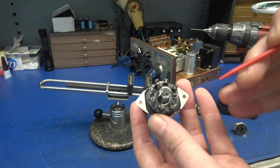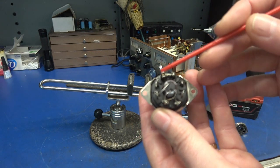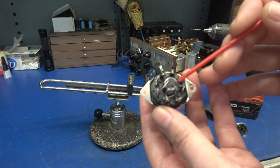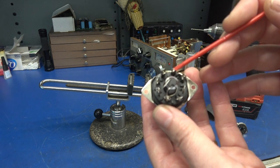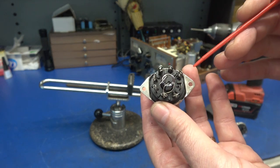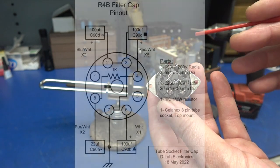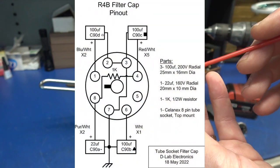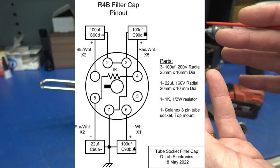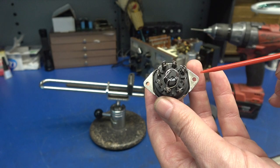Step two is to install your ground jumpers on the base. You see this little 20-gauge wire going between pins two and three, which wraps around and goes to pin seven. That is for this application — I'm going to throw the diagram up real quick. I'm actually wiring this for the base of the R4B filter capacitor. Your jumper locations may vary.